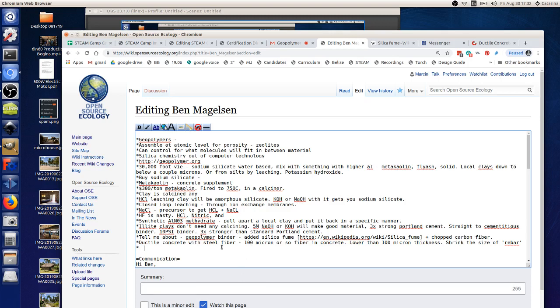I actually built the aggregates from the bottom up using geologic chemistry — they end up being about 100 nanometers in size. With materials like that, if I took a plastic mold that was perfectly smooth but had a little scrape on the bottom, even a couple microns in size, this material will reproduce the scrape in the mold. Because the aggregates are so small, you can cast to that fine a detail.